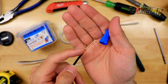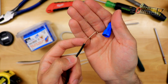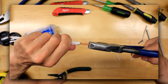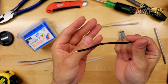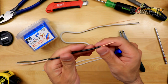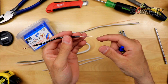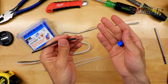A lot of people are very aggressive when it comes to stripping and many times they score the wire. Copper is very brittle — we want to make sure we are protecting the integrity of the wire. I want to talk about how to make it easy on you. When you're first getting started, it's going to be very hard on your thumb. Stripping the wire a little bit longer is going to make your life easier.